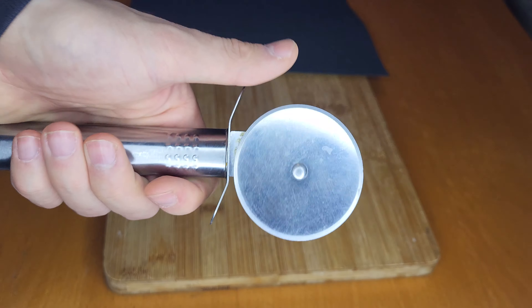For tools, all we need is a piece of sandpaper — I'm using 220 grit, it's wet and dry paper but we are using it dry here just for simplicity. I'm putting it on my cutting board just to protect my table. And then what we do, as we always do in these videos, we're gonna cover the edge in sharpie just to make sharpening a bit easier so we can see where we are taking away material.